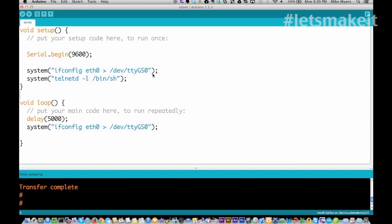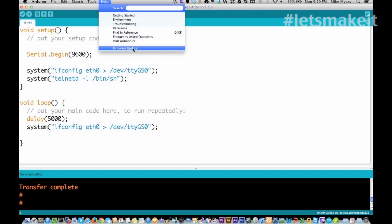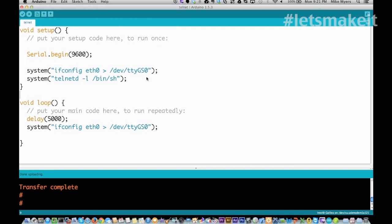It's very difficult to get your head wrapped around at first. With the first one I got, I thought I had broken it — it turned out that when you do a typical Arduino, if you go into the serial port, it's generally the TTY interface, but on this one it's the CU interface. To do upgrades, you have to take out the microSD card, reboot it, then go to Help and do a firmware update.